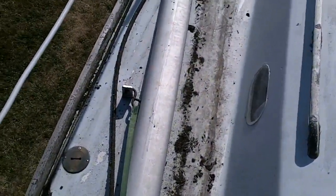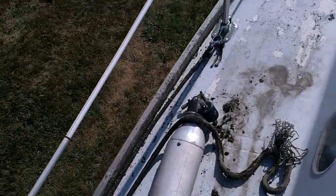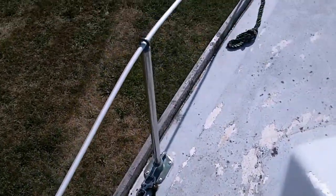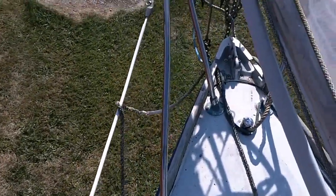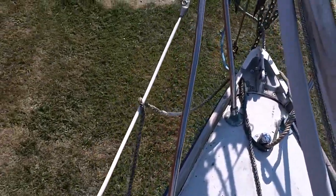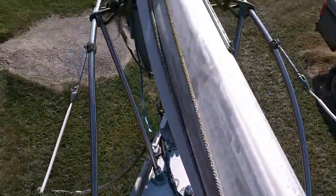I've got a boom — this is the rolling or reefing roller boom, and that was in good shape. Following along, there are no soft spots on the deck. That's one thing I checked for — I wanted good bones, and she has good bones. No soft spots in the deck, no soft spots in the hull. Tapping down with a rubber mallet listening for that tone — nothing there.